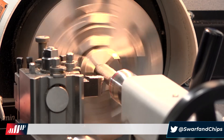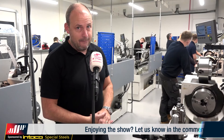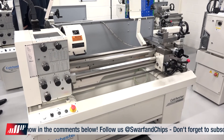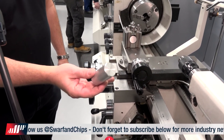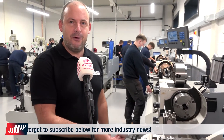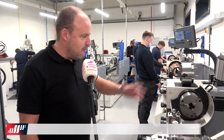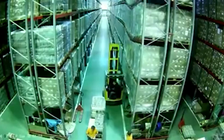I used to go in once a week and try to get to grips with the machines and what they did to make components. Today I'm going to take myself right back in time and get my hands on this Colchester machine — a Colchester Student. I'm going to turn a piece of aluminium: turn the diameter, face it, and part it off. These are all operations I used to encounter daily, setting feeds and speeds. I've got full authority here and we've gone through all the health and safety checks.